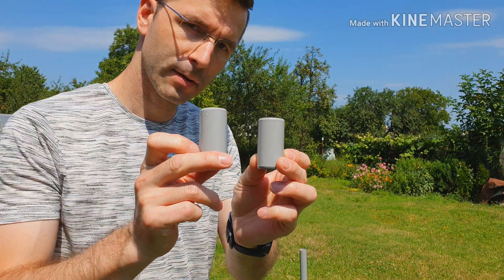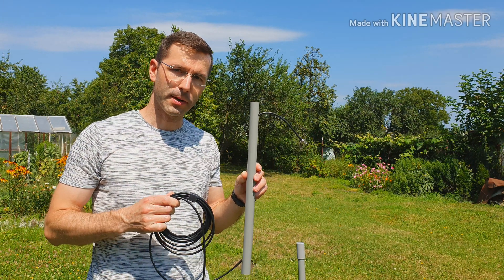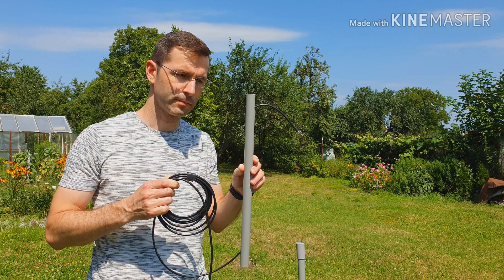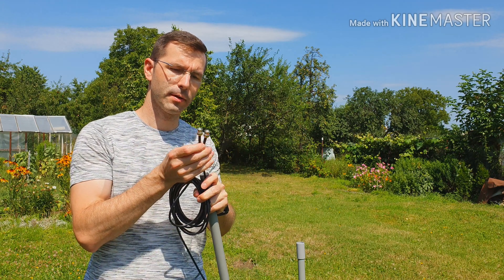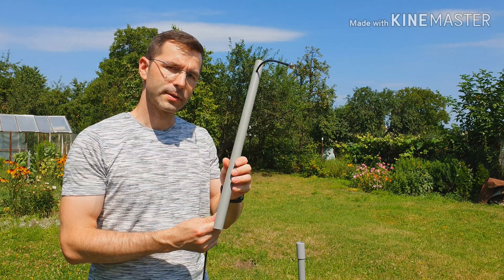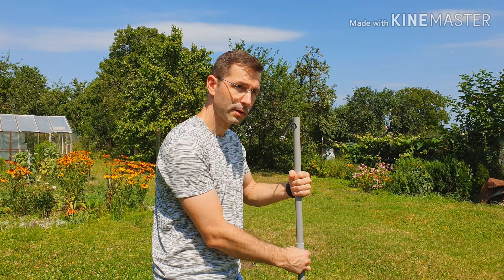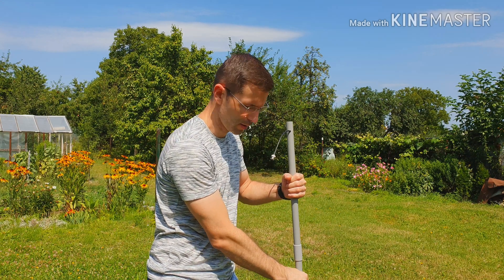You have got in the package two clutches. The first clutch — please pull it on top of the bottom part of the ultralight magnetic loop. This is the middle part of the magnetic loop antenna. The middle part is attached by the RG-58 coaxial cable with two BNC connectors on both sides. Attach the middle part of the antenna on the clutch between the bottom part and top part of the antenna. Push the pipe inside as much as possible.